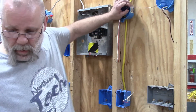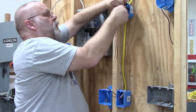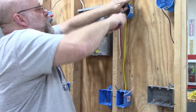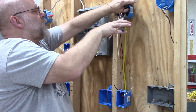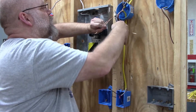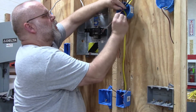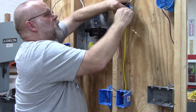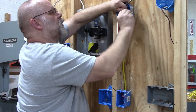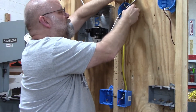Up in this box I have three wires. First I'm going to twist my copper wires together using my Lineman's pliers — pull and twist at the same time to get a nice tight twist. Then I'll snip off two of them and put a green wire nut over the top to hold them together.